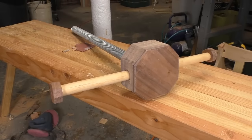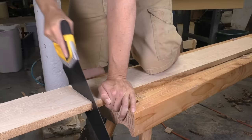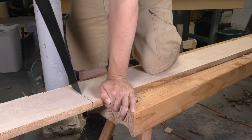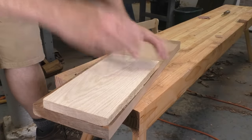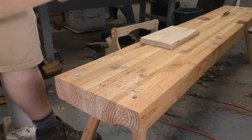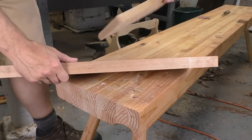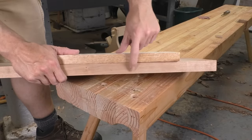Now we can work on the jaws. We're going to start off with three pieces of hardwood — they're going to be as long as your bench is wide and about six and a half inches from top to bottom. I've got all the measurements and details on the plans available on my website. Whenever I'm doing identical pieces like this, I like to cut the first one, check it for length, and then use that as a template for cutting the other two — that way there are no mistakes. If you can, it's really handy to have one of your jaw pieces be a little bit thicker than the other two. For my vise, I'm using a piece of one-and-a-quarter-inch cherry, and that's going to help the whole thing work better.